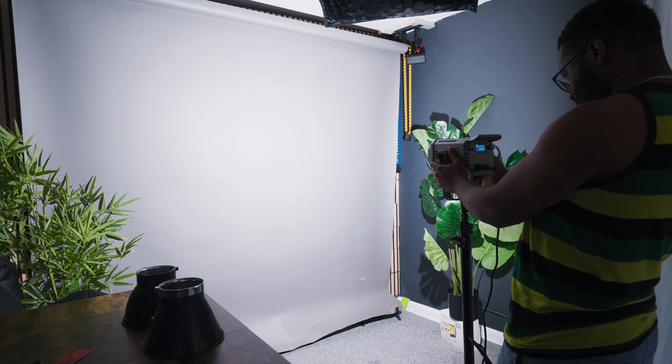This is the first Bowens reflector I've seen with a slight curve to it — most I've tried have been straight. The spec sheet claims 7,577 lux at 5600 Kelvin without the reflector at 1 meter, and 49,200 lux with the reflector installed. At 3000 Kelvin at 1 meter, they claim 6,338 lux without the reflector and 39,500 lux with the reflector installed.